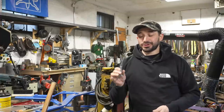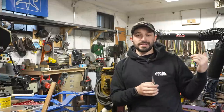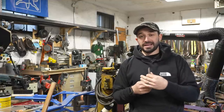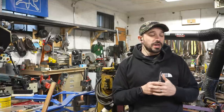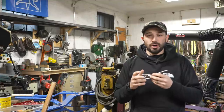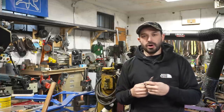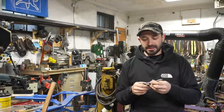That about does it for this video. I'm super happy with how these things came out. Making a pair of scissors has been something I've really wanted to do for a long time. Paul Pinto and I attempted to make a pair a couple of years ago — we didn't really have the right stuff and weren't really prepared for it, and it went horribly. So walking into this project, I didn't really think it was going to go as well as it did. Using the induction forge just made it that much easier — instead of having to put this thing in and out of a gas forge or a coal forge all day, I was able to just heat it as I needed. What was also really cool was this is a relatively small part, and I have a bad habit of leaving things in a propane forge too long and letting them get too hot, which actually makes forging them a little bit harder — they're a little too soft. With the induction forge, I was able to really watch the temperature, make sure I didn't overheat them, and isolate areas.